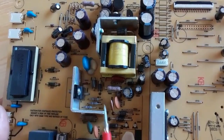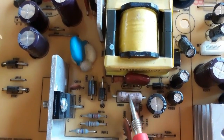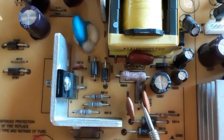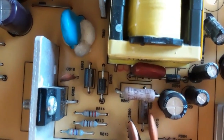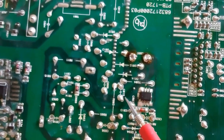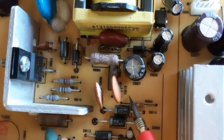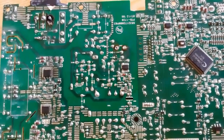This is a resistor. This kind of component is a resistor. Here we also have ceramic capacitors — the ceramic capacitors are not polarized. The reference of these capacitors always begins with C. In the other side, this is it. Let's remove these two capacitors — this is C815. Let's desolder these two capacitors using the soldering iron with the soldering pump.